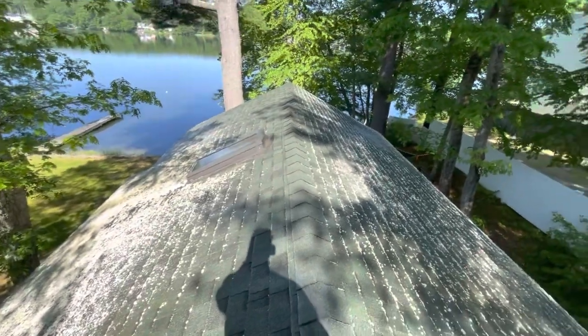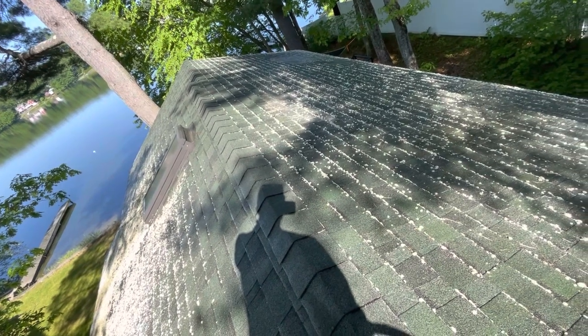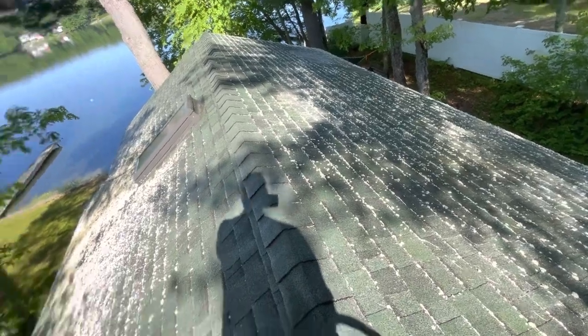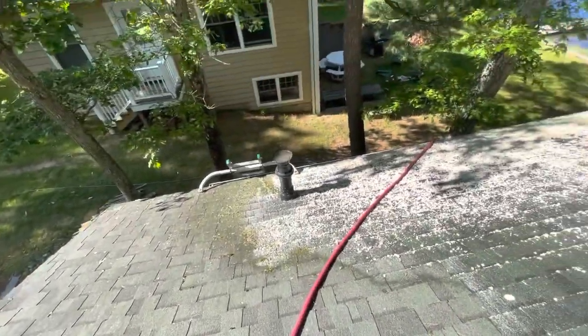And I got a pro tip for you. Should be obvious, but don't stand on the moss you've treated unless you want to fall on your behind and slide off the roof. So leave yourself a dry way to get down. Shoot the last section from the ladder.